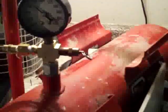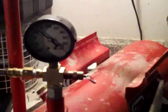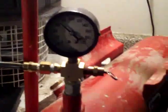We're at about 70 pounds per square inch now, and the boiler's holding up really well. Like I said in a previous video, it was tested to 250 PSI of air, and these big TIG welds are pretty strong.